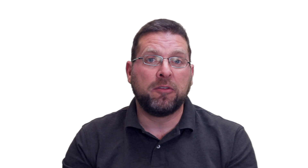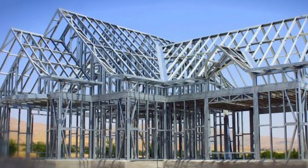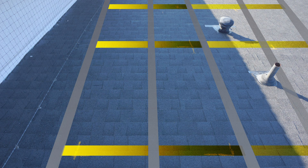Another common example where wood blocking is very helpful is metal rafters. It's not typically possible to have your roof attachment threaded directly into metal rafters, so installing wood blocking between rafters is the practical approach to resolve that issue.